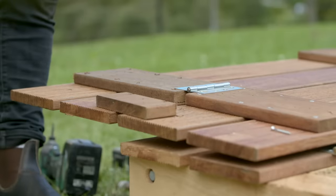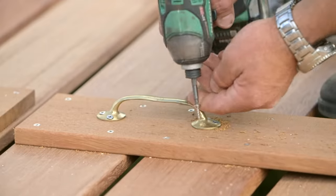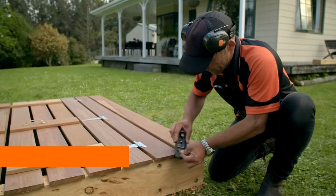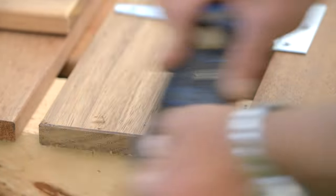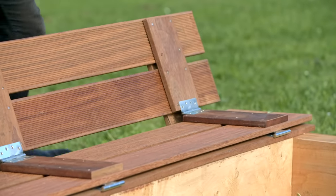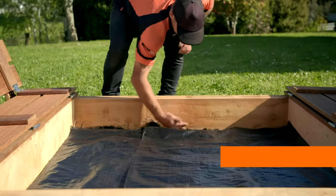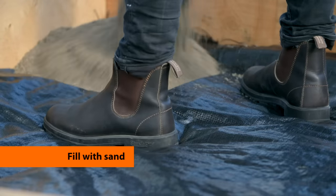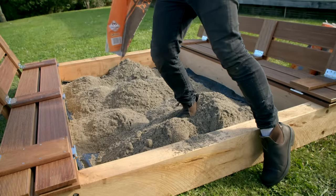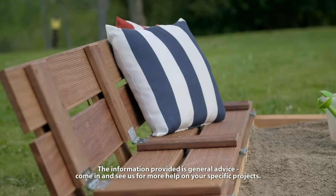That's this side fully done, so I'll do the same for the other cover. Then I'll attach a handle to each cover — because the covers are made from hardwood decking, they'll be pretty heavy. Finally, I'll take the edges off with the block plane so there's no chance of splinters. All we've got to do now is throw a little bit of weed mat down, put the sand in, and see what the kids think. It's a good idea to lay weed mat under the seating areas as well. So that's your sandpit done — easy as. Don't forget to subscribe to the Mitre 10 YouTube channel for more handy content.